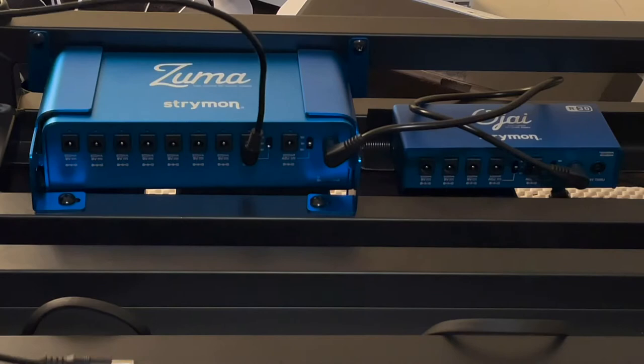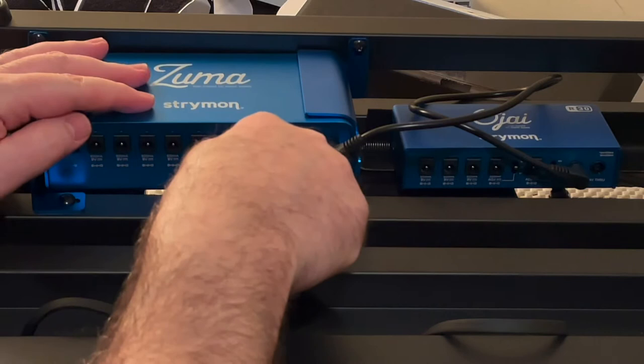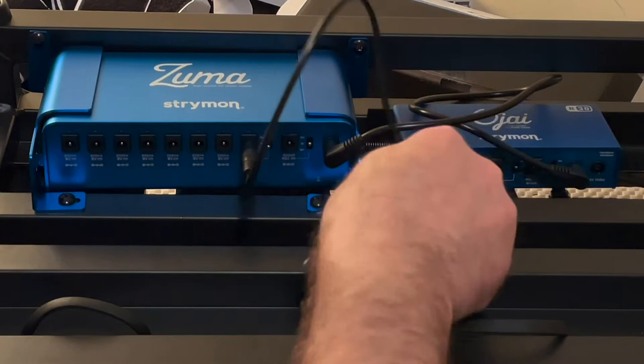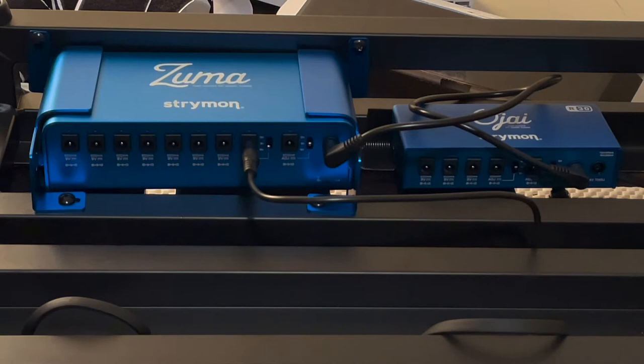I don't want to risk the possibility that I get confused about which wire is which, and then I plug an 18 volt supply into a 9 volt device. So I'm just going to take a little bit of colored tape. This is duct tape. I'm going to make a flag out of it for now. Drop that through. And the rest I don't have to be as careful about because they're all 9 volters, which is the typical voltage for these things.